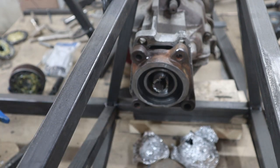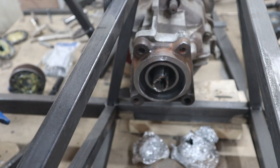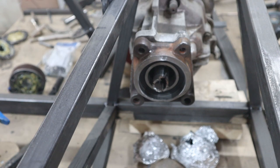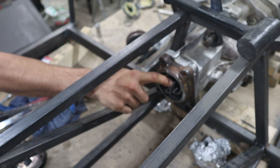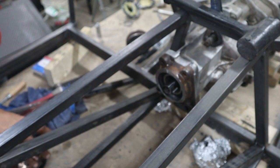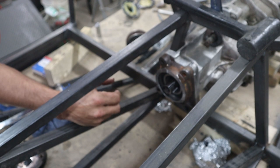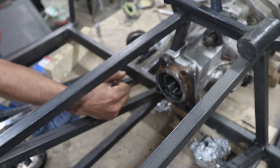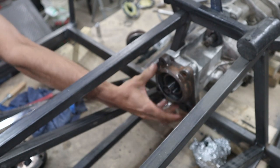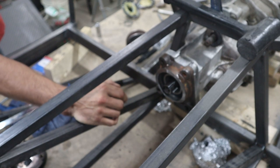Well, I was trying to find a soft mallet, but can't seem to find them. Might have to do with the bolts. Okay, so I had to do a bit of machine work on this. My next piece that goes on was a little bit too tight, so it was squeezing it together too much to put it onto the shaft. So I got this just tapped in with those two dowels there that you saw.